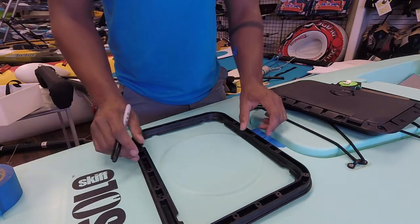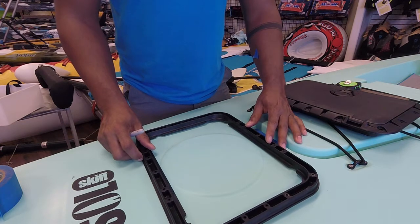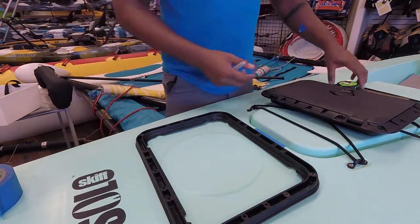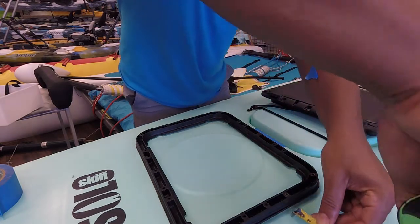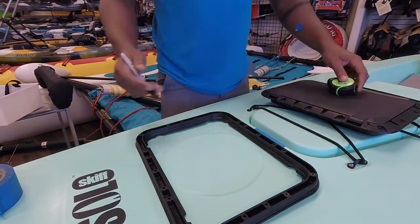So what I like to do is stage the inside of this square frame right at the edge of that bevel. I will set up my center line. You can eye this out, or you can actually take measurements from the rails, about 5 inches at the first screw line, 5 inches on the second. So we're pretty much centered.